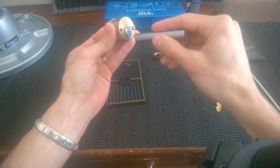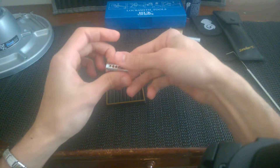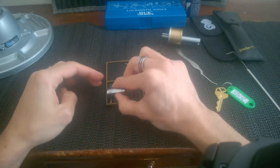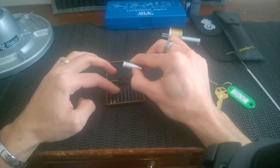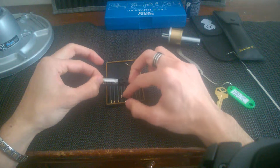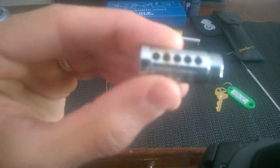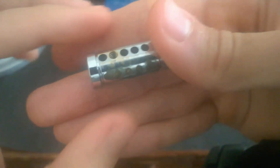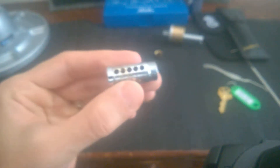Even bigger - this one is better. T-pin on 1. Just a bullish one. T-pin on 2. T-pin in 3. T-pin in 4. And another spool-ish, or more of a serrated T-pin in 5. Let's take a look at the core. You can see some threading - some threading in 2. It's pretty smooth in the other chambers. So nothing in 1, 3, 4, and 5.